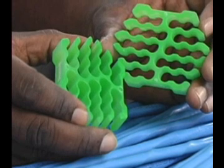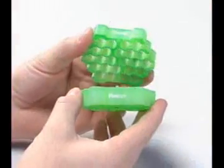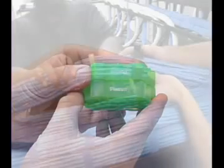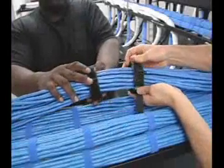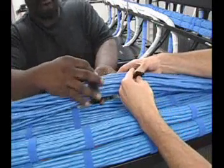The insert design also includes a pocket and boss feature that help align two corresponding inserts perfectly for identical, twist-free cable placement in both inserts. This exclusive feature of the Panduit Cable Bundle Organizing Tool enables installers to start organizing the cable from the middle of the bundle.